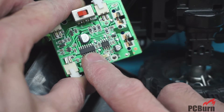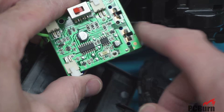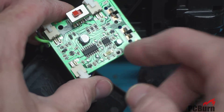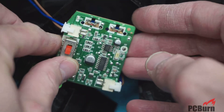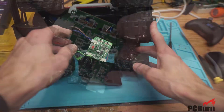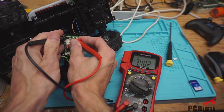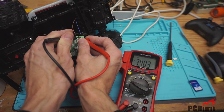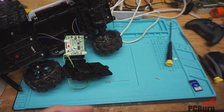These are the control chips — just marked for New Bright — plus another voltage regulator, some supporting circuitry, and the batteries. I'd conjecture that this is probably a battery controller and that's the smarts for the entire unit: the motor controls and logic. Both batteries are testing out okay at 3.4 volts, so that's good.